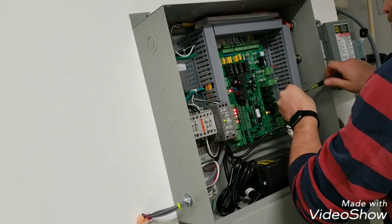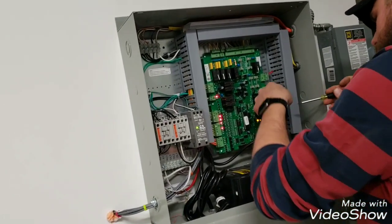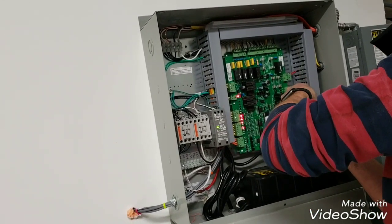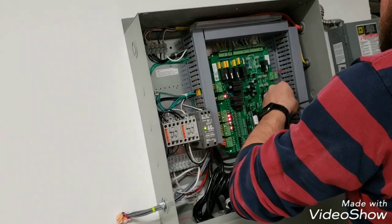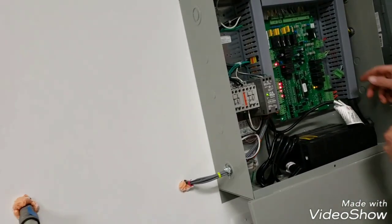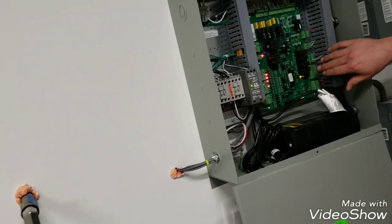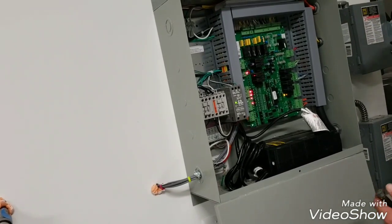There's a lot of ways to get out. Most of the time if you get stuck in the elevator, it's going to be on the floor — there's not really a whole lot that can happen in between that's going to make it shut down. So the problem was those four wires in the — I call it the lock box — that was the problem. Yeah, they were just pinched and it was just letting the voltage travel through. It was shorting out. I just unhooked it — I figure if I unplug that because that's all the locks for every floor, if I unhook it and it turns on, I'll just start unwiring it one at a time until I figure out what floor the short's in.